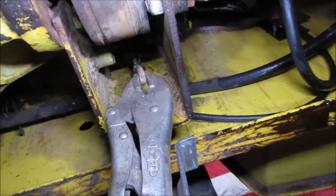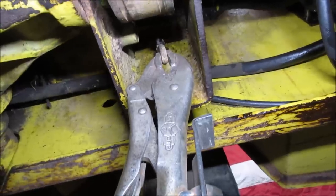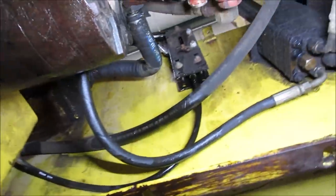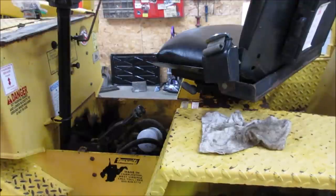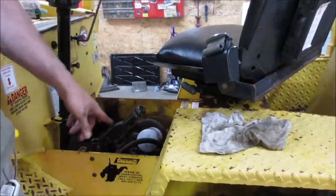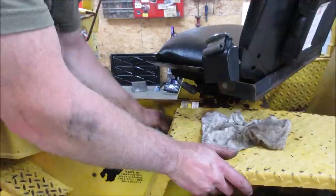And I am not looking forward to it. You tried shoving the cable through a socket, maybe? Even with that, no. All right, I'm gonna go tug on it the other way, see if we can get anything out of it. So I still have the slide hammer on the bottom, and I lowered the lift just so it's touching the floor so I could have an idea. If it came up off the floor, I would know the cable moved. And I ran this up about 3/4 of an inch, but.